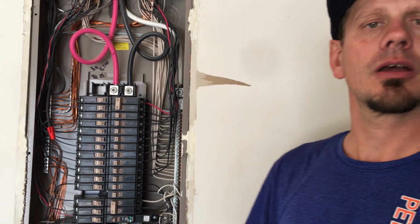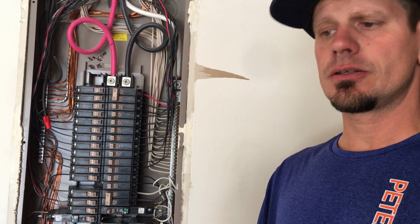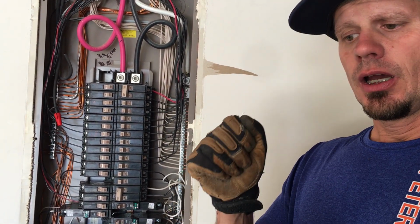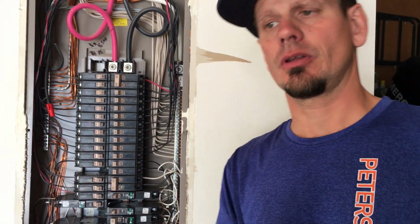Some of you guys have given me comments on don't use your light bulb, because I did a video 6 years ago that you guys keep getting hung up on. You're right. We could do that with a 2-pole and trace it. And I did do that. I traced out making sure I did neutral to ground, and that's what helped me on a power circuit. But if you do a neutral ground continuity test with your multimeter and you're doing that with light bulbs, that's not going to do you a damn bit of good.